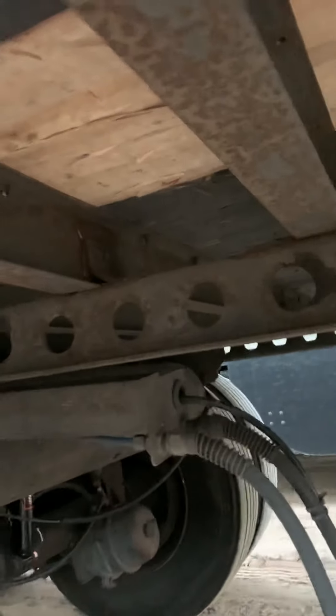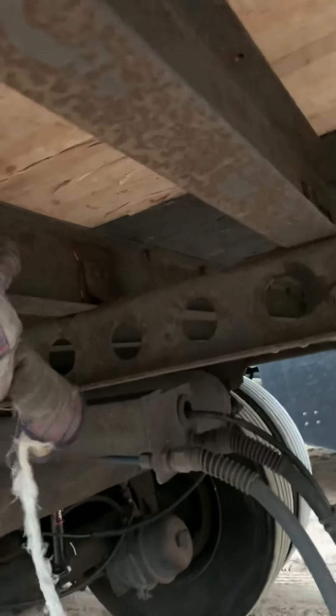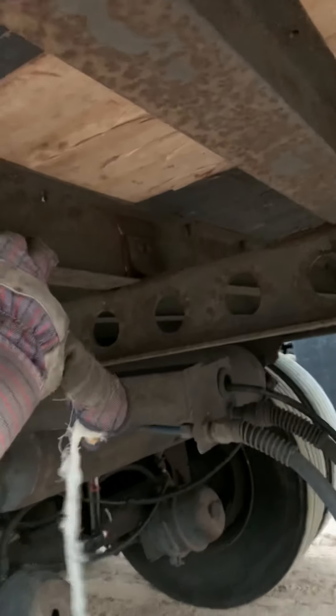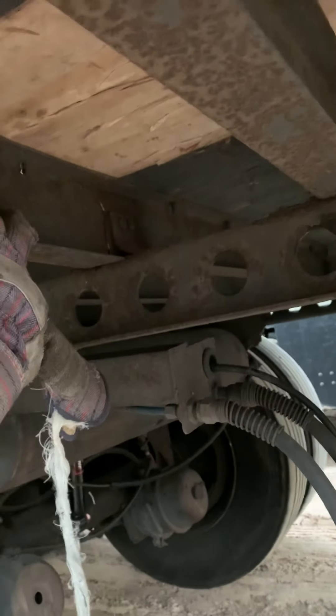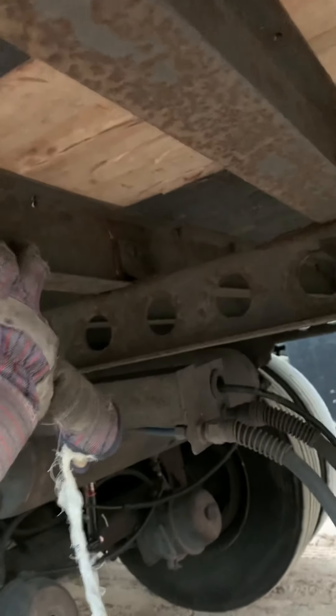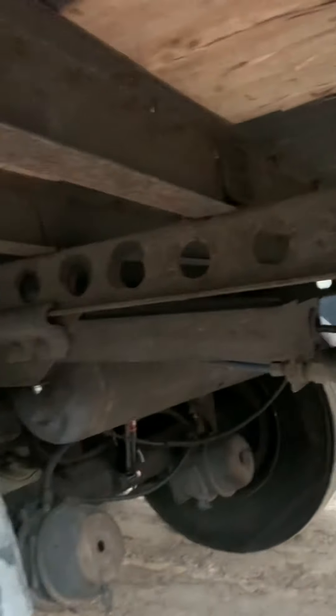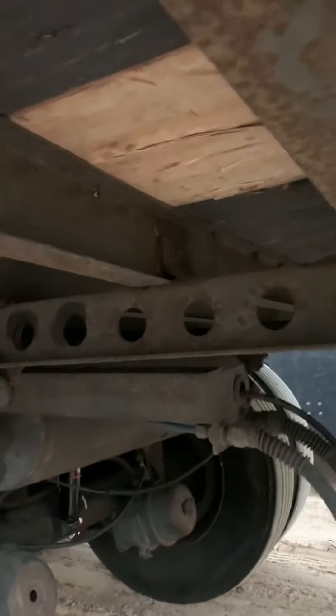So just do a good pre-trip and look for hairline fractures. Again, these didn't show up until you put some weight on them — some things are just not visible until you put them in the field, put them to work, put some weight on them, and watch the procedure. That was very close. They unloaded it and I decommissioned the thing.